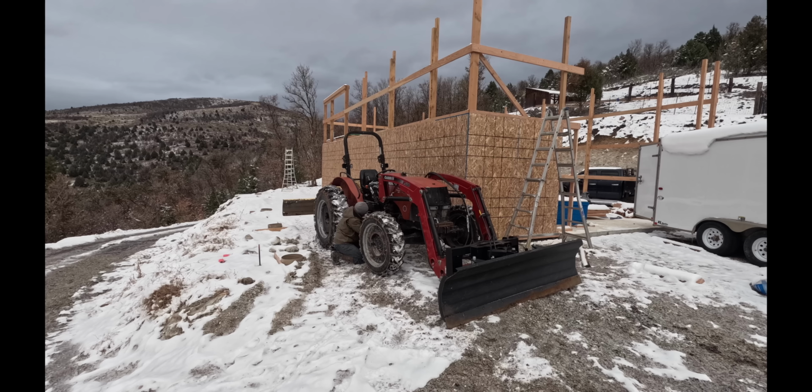After a little pre-work discussion, we decided that the lowest layer of plywood needed to be on the walls for the flashing to install correctly before the concrete. This meant that we needed to frame out the door and the two windows that go on this wall before we could get things moving with the plywood.